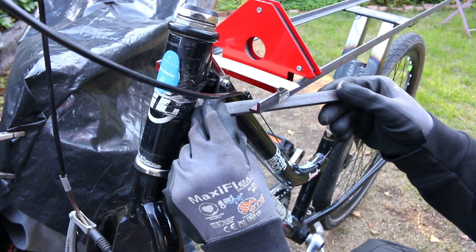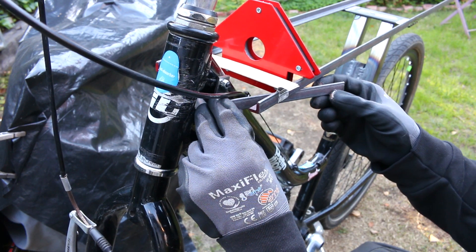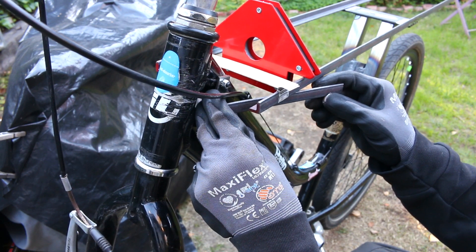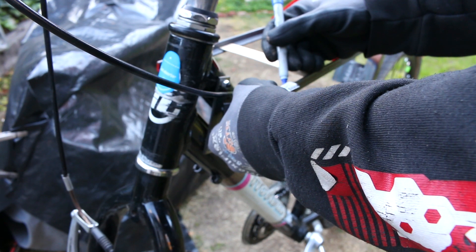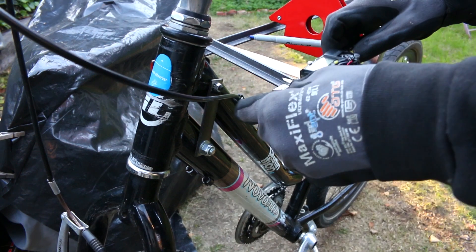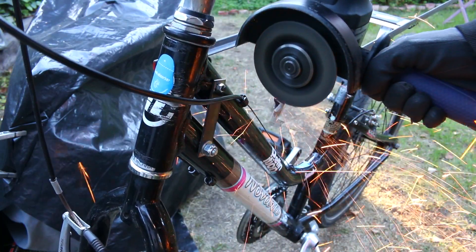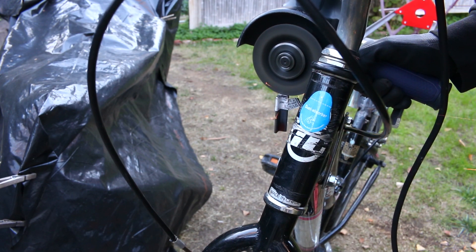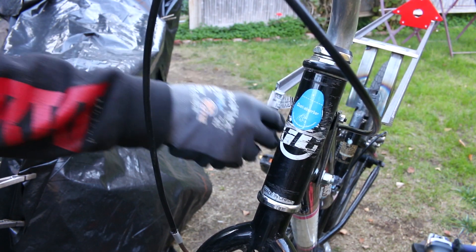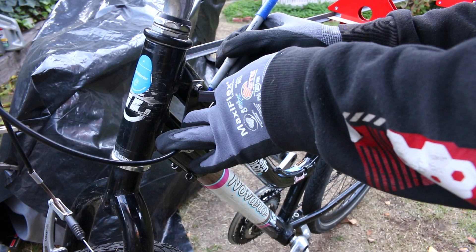You might be thinking this thing looks real strange, wacky, bizarre — but just trust me, it's going to look like a real bike at some point. This project posed a lot of challenges, and you don't really see how much thought goes into figuring all of this out. I had to figure out how to attach the side rails to the front brackets — debating going parallel with the ground versus angling them down slightly. Having them parallel looked nice, but angling them down just fit a little better, so I played around with the angles.